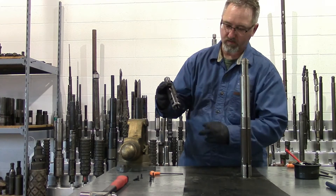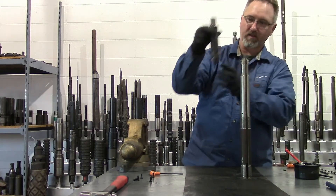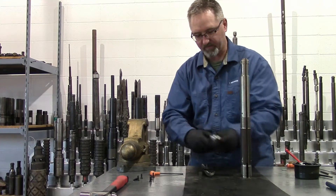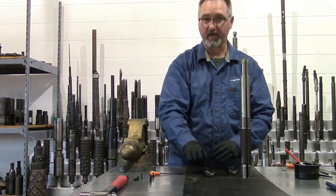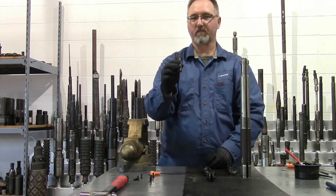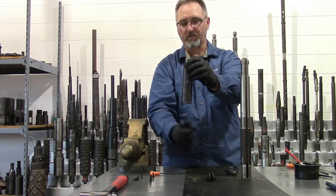What happens is the bean makes contact with your rope socket. It's activated, it pushes down, and activates the cam which turns against the cutter block and snips the line. Inside here we have the cutter block itself, which has 8 cutting surfaces so it's good for many cuts. The cam itself does the turning and cutting on the line against the block. The bean has shear pin holes — two 1/8-inch shear pin holes which also correspond to the body itself.